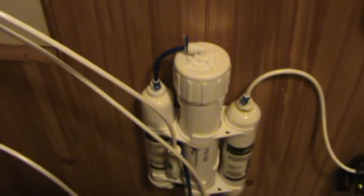Because the water is starting so pure at 8 PPM, it's coming out at about 10 PPM after going through the sediment filters and getting rejected by the reverse osmosis membrane. But it's still very clean water, so I simply put it back in and filter it again through the system.